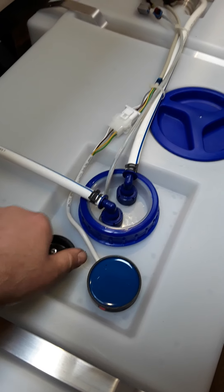You also have a frost valve on the heating system on the boiler. When re-filling the system, make sure this valve is closed. There is a wee blue diamond-shaped button that turns — once you turn that, there is a wee button at the side that pops out. It is hard to see, but you can see the wee button at the side has popped out. That drains your boiler of the hot water. To close it, simply turn the top knob to close it again and push the wee button back in at the side.